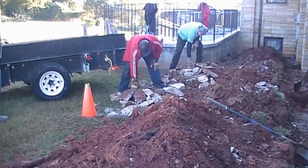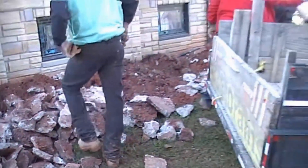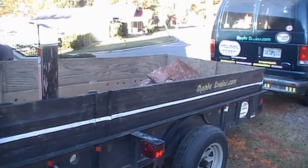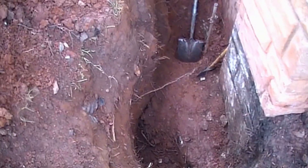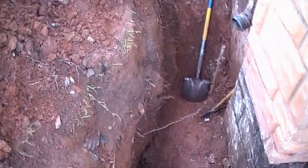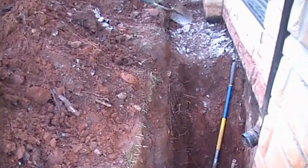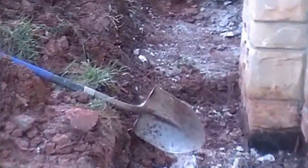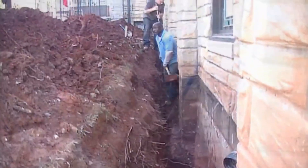We're going to get down there about eight feet to the footer. The footer is where the problem exists — not there at the surface. Trying to fix negative grade with soil and concrete is not going to solve the problem. You've really got to get down to the footer. This is where all that labor comes in and the DIYer can save a great deal of money doing this labor himself. Basement footers are very deep, and if you're not getting down to the footer before you install your French drain — we call it a footer pipe — you're going to have problems. So many videos out here are showing you digging down this wall only a few feet and putting in a French drain; this is going to cause more problems than you can imagine. You've got to get down to the footer.